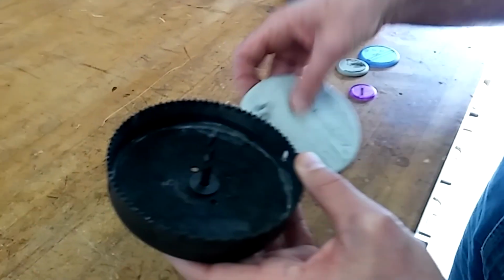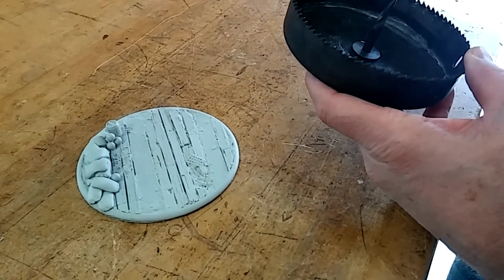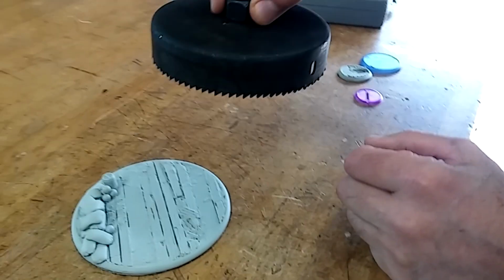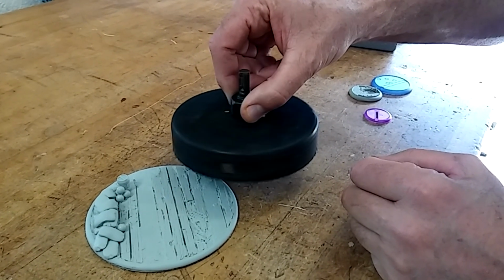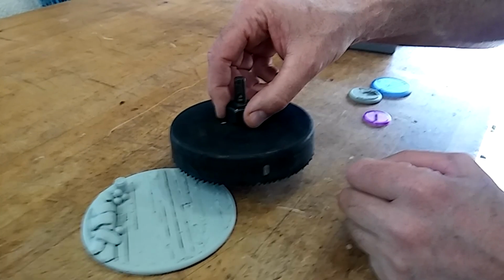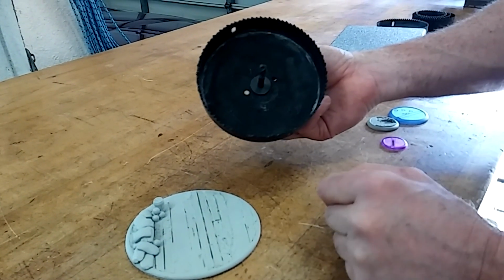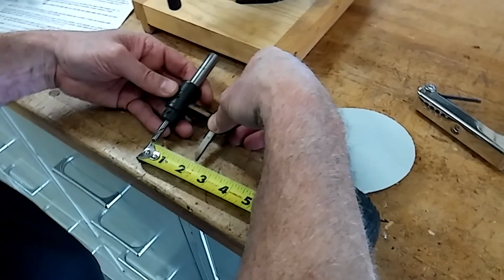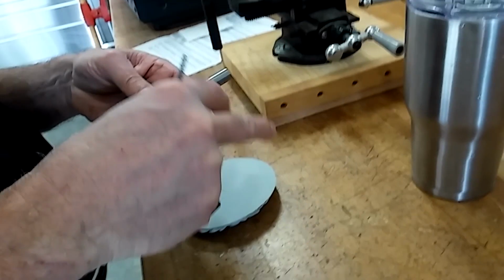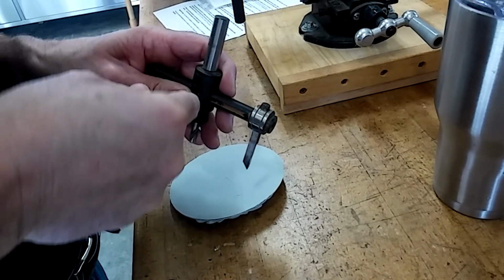Alright, so if we want to make a countersink for this device, or for anything about this diameter and figure, we need to counterbore it. So the idea is that we'll take and counterbore this and make a perfect circle, then we'll later route out the extra material. That has to be done before we put in the other circles within the circle. Size for the device that's going to go in the recess.